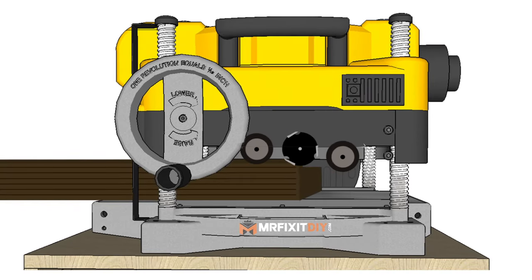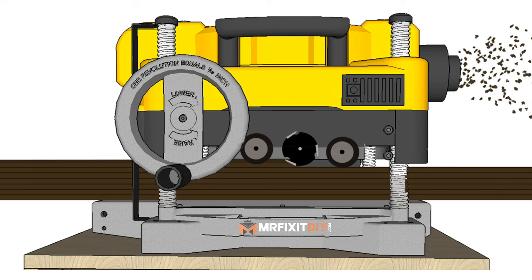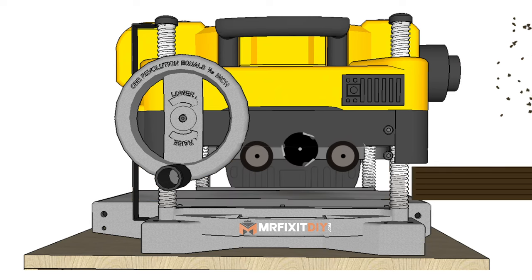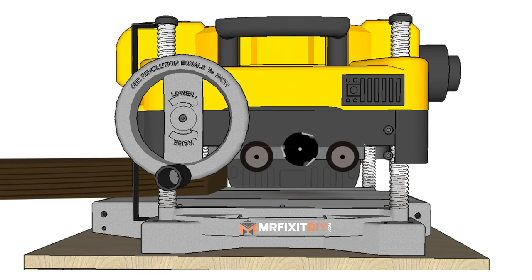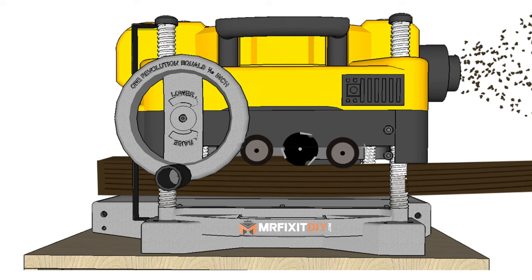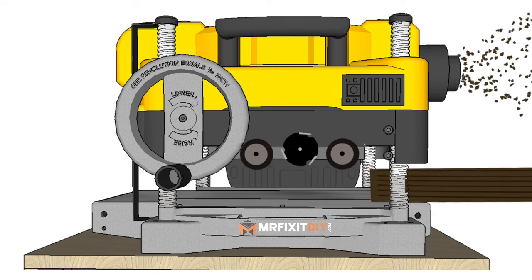As you can see, the wood is fed through the machine. The roller heads press down onto the piece of wood, pushing it down along the deck as the blades cut it to a uniform thickness. Now let's see what happens if we do this with a piece of wood that has a bow in it. As the piece is fed through the machine, the rollers press down on the piece of wood and it follows the bow. So while you'll end up with a piece of wood that's uniform thickness, it won't be flat.